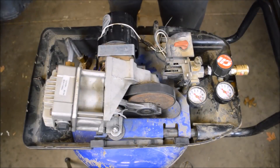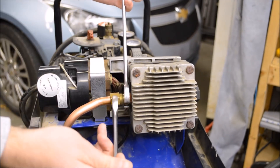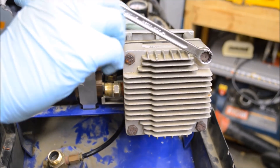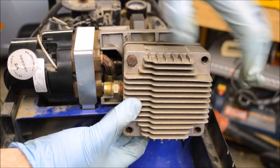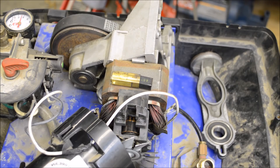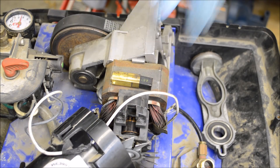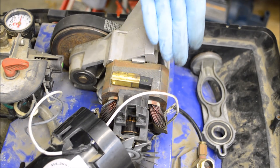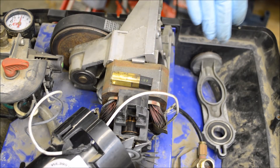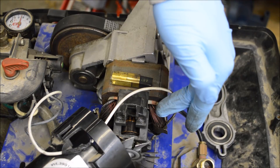If you want detailed information on disassembling this compressor, check out my last two videos. For other brands of compressors, take off the cover, disconnect the exhaust tube, and remove both the head and cylinder. Since I decided to repair this, I wanted to give everything else a quick once-over to make sure there were no obvious problems, especially in the motor — and I got to say, everything looks good. There's no damage that I can see.